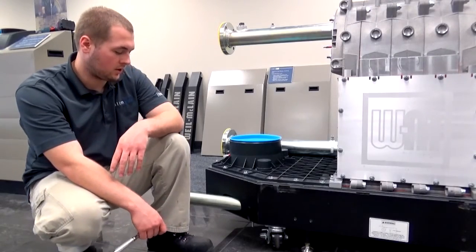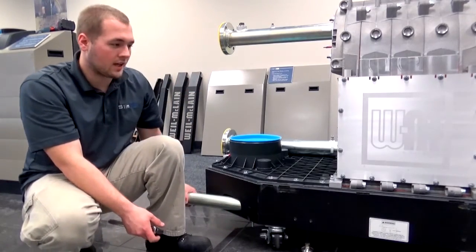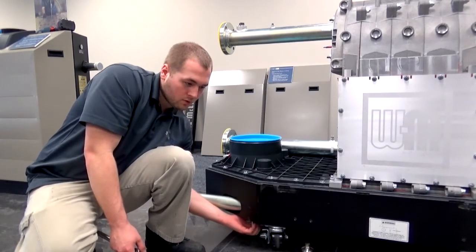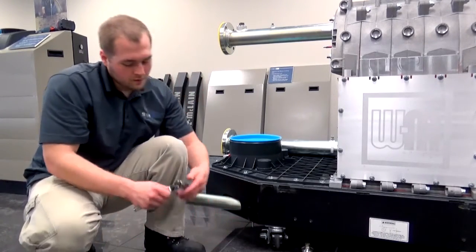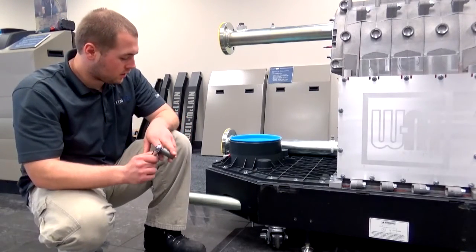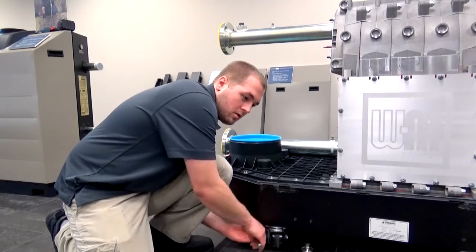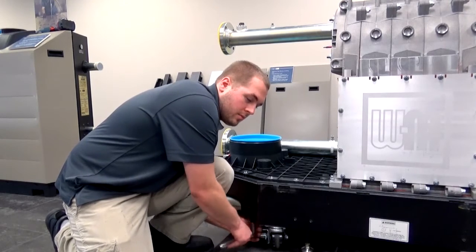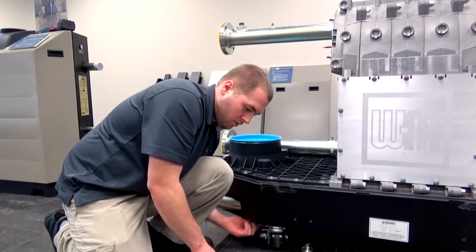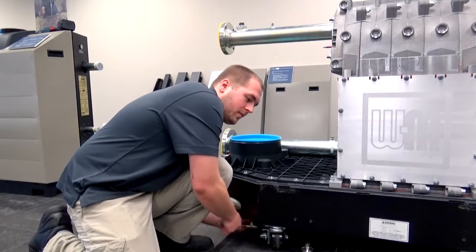We're going to be disconnecting this U-bolt or C-clamp that's running over the gas line on the inside, and you can see where the bolt comes out in 2 different locations, right here and right here. And you're going to be using your 9/16 socket with ratchet and loosen it up. You don't have to remove it completely, just loosen it about probably halfway.